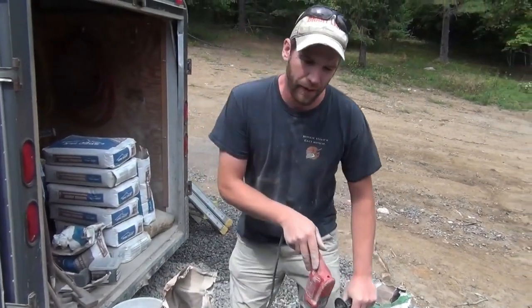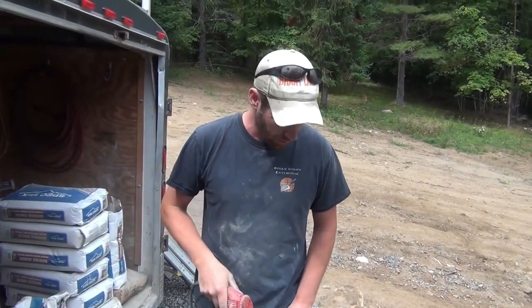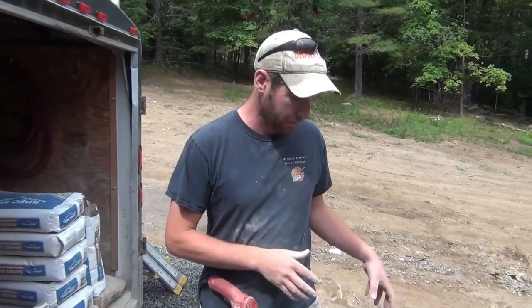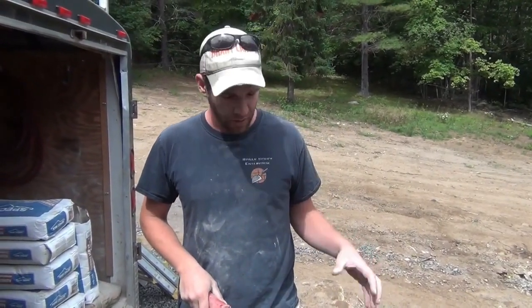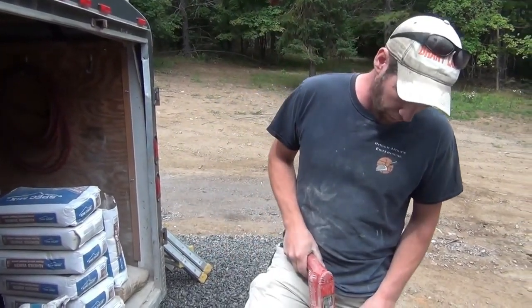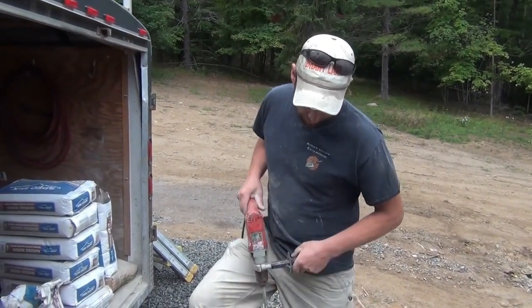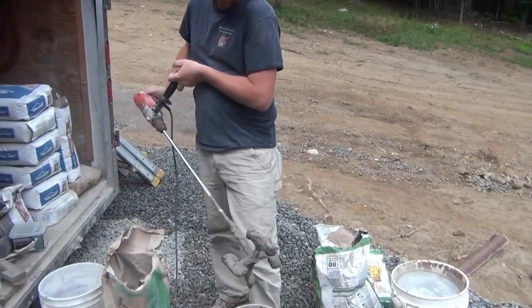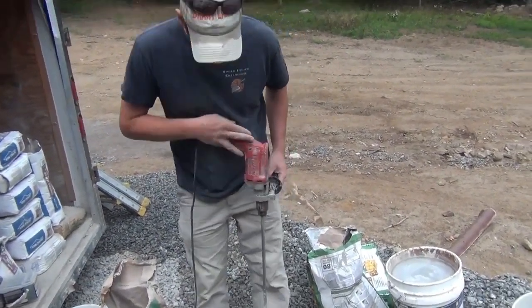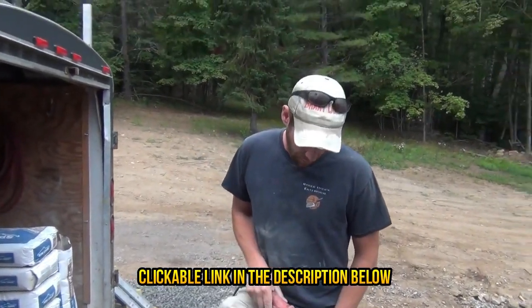We're mixing it thoroughly. As I've explained in other videos, the thin veneer mortar uses polymeric mortar, but this is a much simpler mix — just add water and mix. Even so, I'm breaking up any compression clumps with the paddle bit. I'm using a sheetrock mortar mixer paddle and a Milwaukee Magnum drill — I'll put those links below — those are my favorites for mixing mortar.